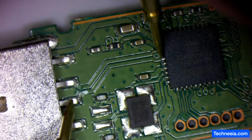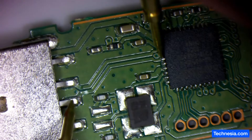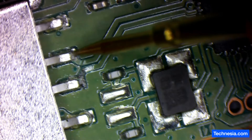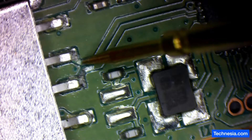This other one should go to this pin — no connection right there. All right, here's the problem. This connection is breaking right here, and this other pin doesn't look good at all. So let's reconnect both of these pins and hopefully recover the data.